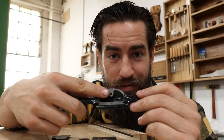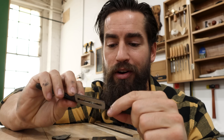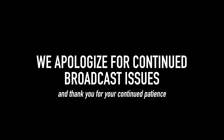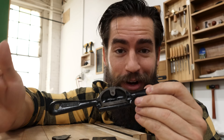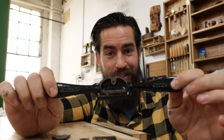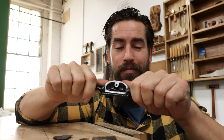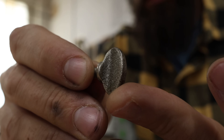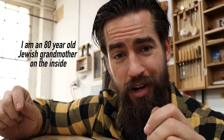As long as the toe in front of the cutting action and the heel behind it are clean, the sole is going to work perfectly. The bedding of this tool is now clean and free of paint. Not absolutely spick and span, but it's functionally good — and that's what we're looking for in a restoration like this. The casting itself, after a rub down with 3-in-1 and 4-aught steel wool, looks good and feels good. Our thumb screw looks good — this is purely aesthetic as long as the threads are clean and not gunked up with any schmutz.